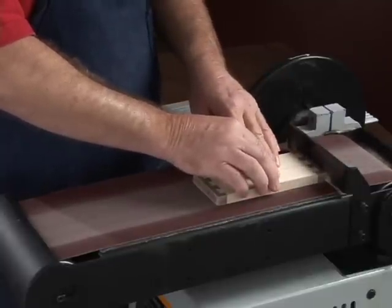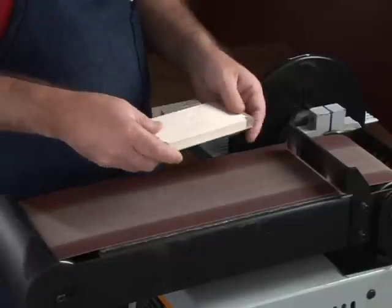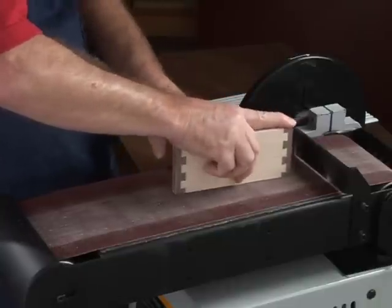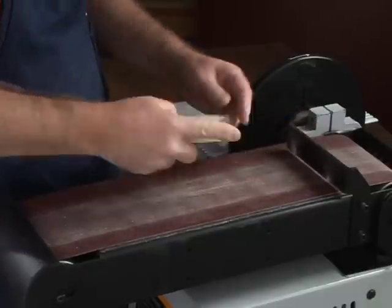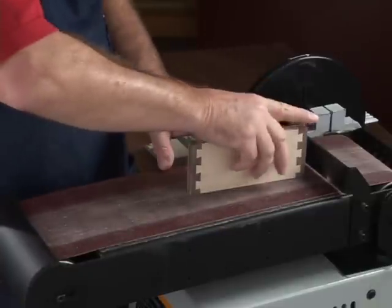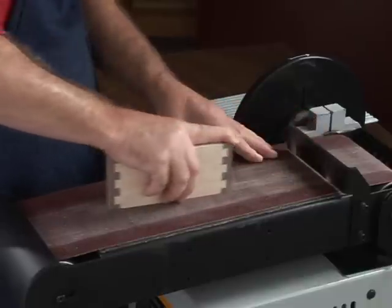After sanding both faces of both pieces, turn off the sander and then use the stationary belt to remove any squeeze out or overhang of the corner post along the edges of the material. To be clear, we are sanding the dark corner post pieces flush with the edges of the lighter piece, not the other way around. You do not want to change the width of the larger pieces.